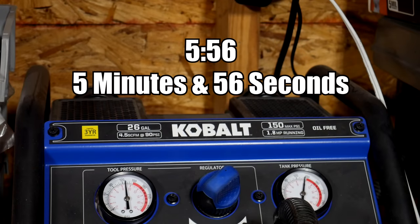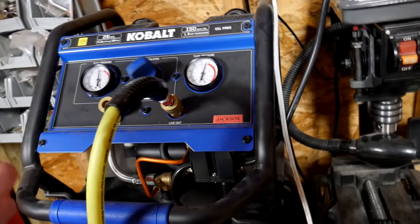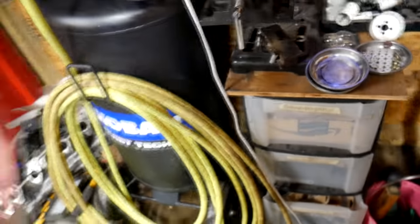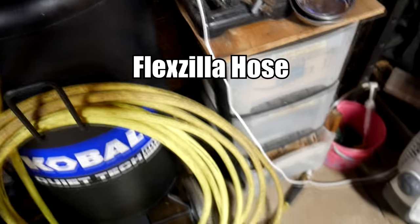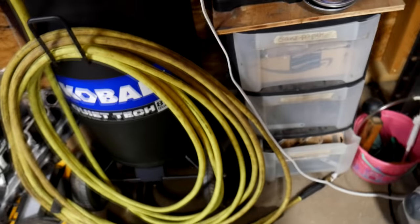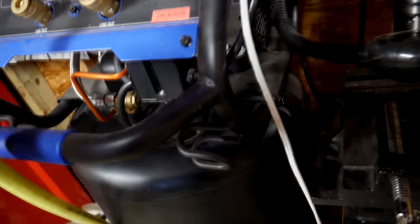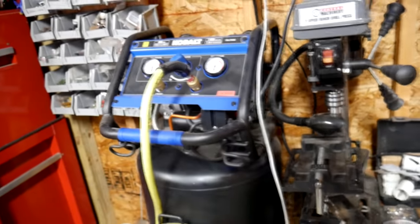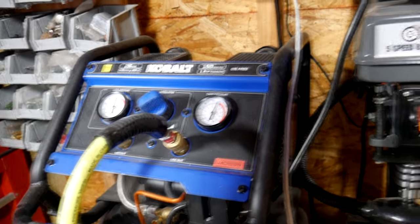It looks like we were a little under six minutes for 150 PSI across 26 gallons, and it also filled up the hose — the regulator was turned on — so it did fill up 50 feet of hose as well. By the way, I highly recommend this hose — I can never remember what it's called, it's basically a rubber-PVC hybrid, I think it's called Flex something. It's expensive but it's really good hose — extremely flexible yet very strong. That's what we used at the shops. Don't mess with the orange PVC Harbor Freight hose; they just don't work like these do.